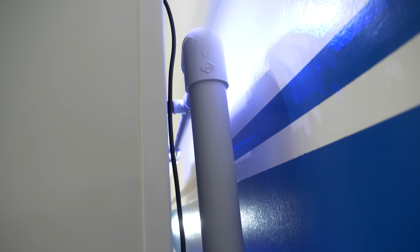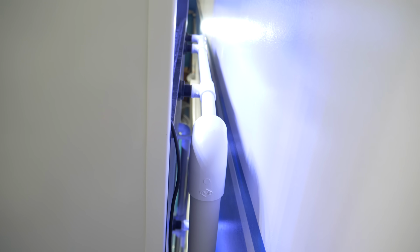I've never done this before, but I used inch and a half just on the riser, and then it goes down to 3/4 inch, and then it feeds into the 1/2 inch bulkhead. So really interesting. I'm actually very pleased with the performance of the pump. I wasn't sure if it was going to be able to push that high through small outlets with pressure, but I can tell you I actually have the pump turned down, because it's providing more than enough water flow.